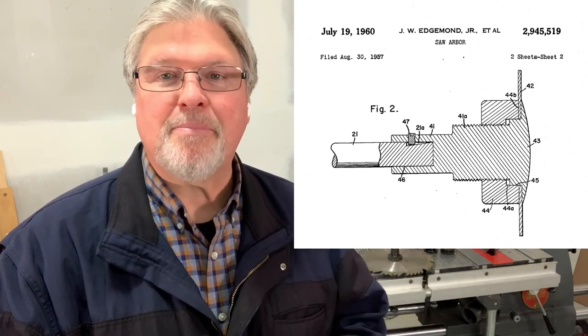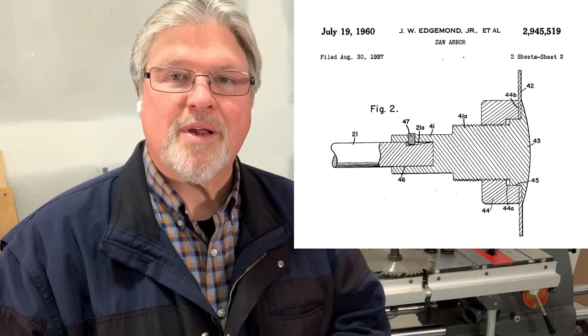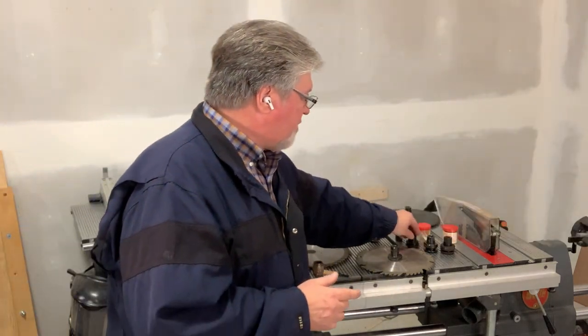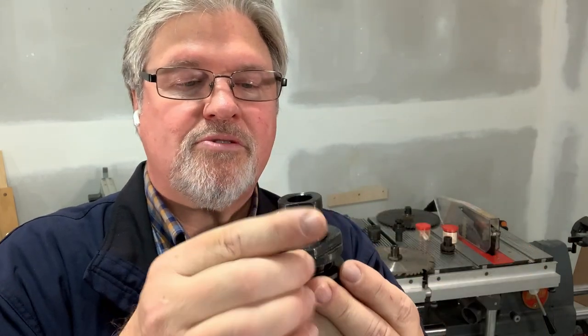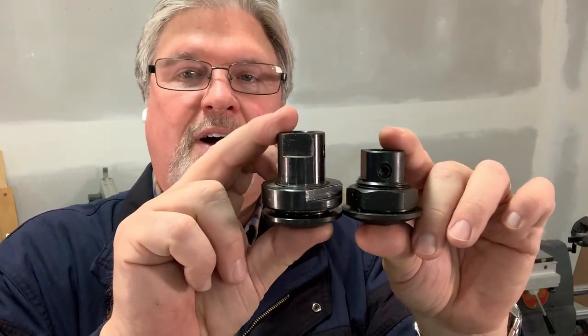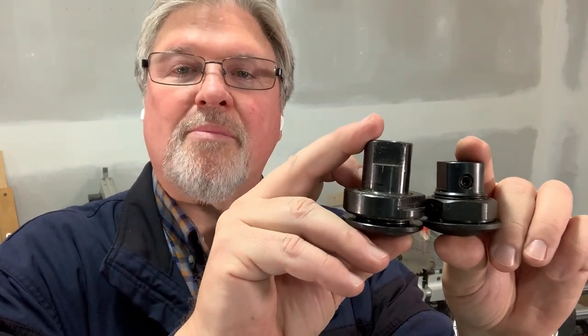What's interesting about the patent is it doesn't talk about the need for an inch and a quarter hole, but what it talks about is safety. And by the way, I have two different arbors — actually a bunch of arbors. Two versions of the inch and a quarter arbor. This would have been the original one from the Mark V, what we now know as the Model 500. And here is the arbor for the inch and a quarter blade for the Mark V Model 510 and the current Mark VII. You can see it's a little bit longer, which pulls it away from the headstock, making more room for the lower saw guard as we know today.